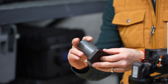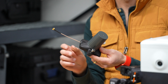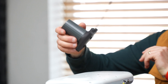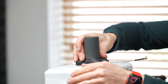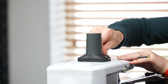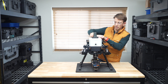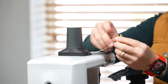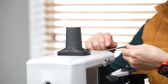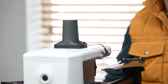The last step is installing the GNSS mount, which has a retained thumb screw and an MCX snap-on connector. To mount it to the top of the IF800, you'll see two teeth on the bottom of the mount that notch into the top of the IF800 — push the mount into place, then use the thumb screw in the back to screw it down until secure. Last but not least, the MCX connector — just immediately behind the navigation light is the female version of that connector; push the two together and you'll hear it snap.